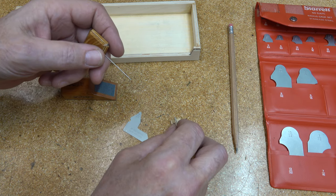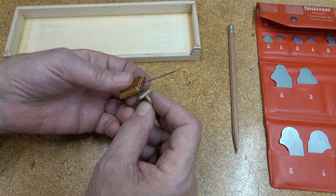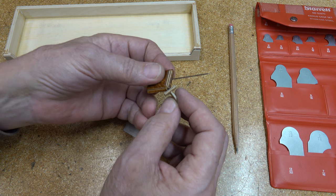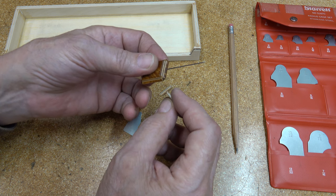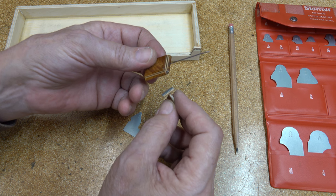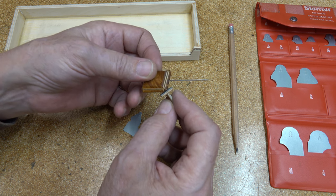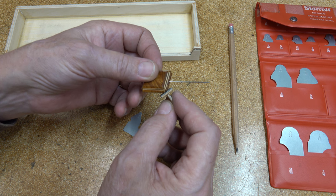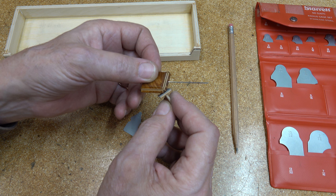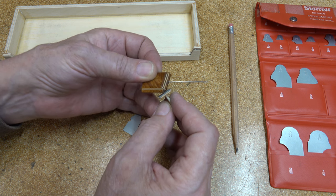Anyway, what you do is you handle your two pieces directly in eye shot so that your eyeball view is always in between the two. So if your sandpaper is at this angle that you're seeing in the camera, you need to have the part you're going to sand at that angle too, and you're literally eyeballing what's flat by having your eye see in between it. And then you're going to take little micro strokes.